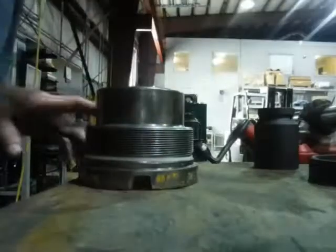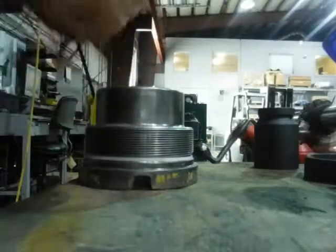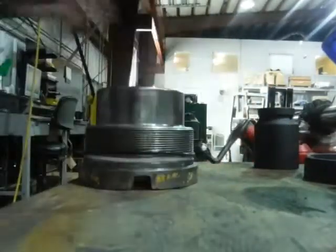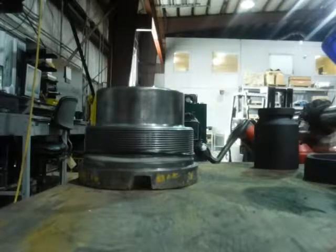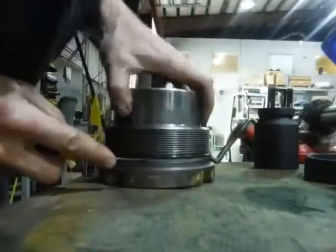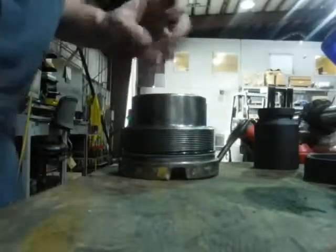This is your O-ring. This particular piece is the backup. For the O-ring, take it and put a little bit of lube on it and just kind of roll it, because when you're threading it in it's going to want to move and bend and roll — you want it to be able to do that. You can leave one part kind of standing up, then put the O-ring in and just work it around. Don't get frustrated when you're doing it — it doesn't come easy. I've been doing this for a good while.